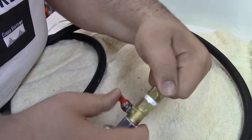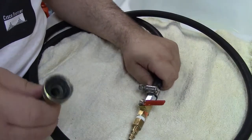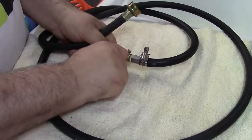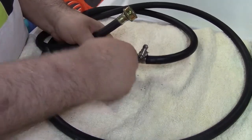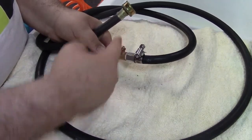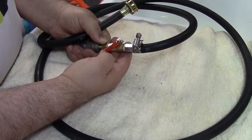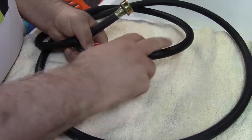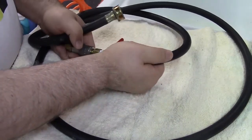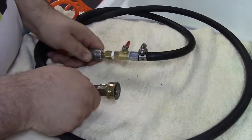You can operate your valve like that — everything works well. Your air goes in here and this screws onto the faucet nearest your sprinkler. Here's the end where the air comes out. You can open it and shut the air — when the handle crosses the path, it's off; when it's parallel, it's on. So you can let a little air through, or more and more. We have a nice tight, airtight fitting on everything, ready to blow out your plumbing or sprinkler system.